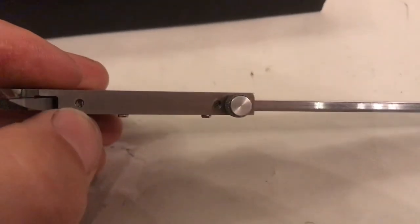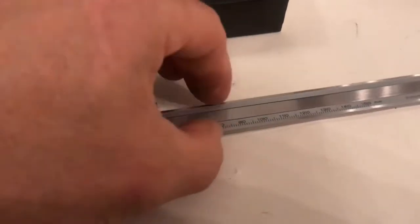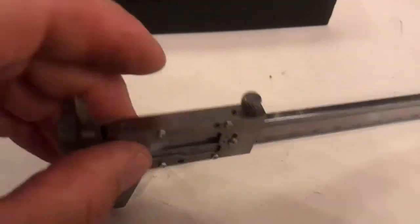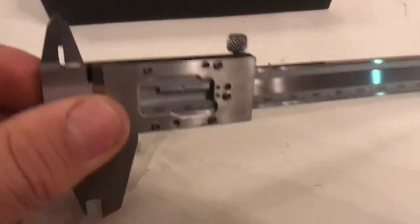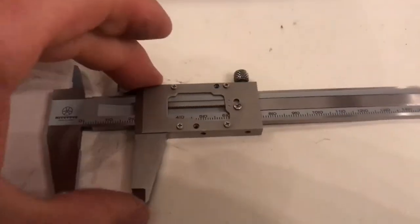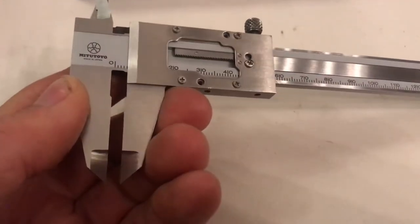A bit of trial and error. I've put both screws in there. If you screw them up tight, it locks that shim hard onto here. What I found to do is screw them both down until they lock tight so you literally won't be able to move it, and then just back it off a fraction — and then it moves. You don't have any slop in it at all. Just play with those until it's nice and smooth but there's no slack in it.